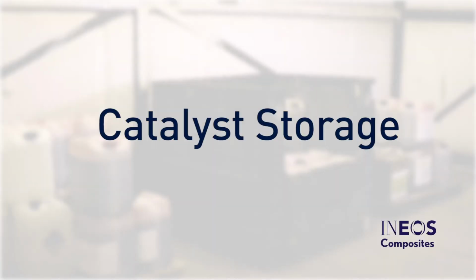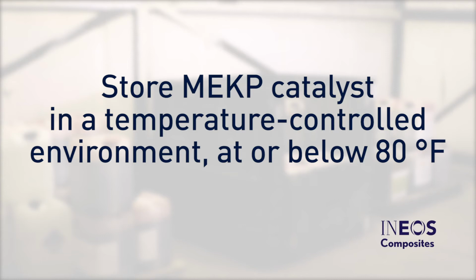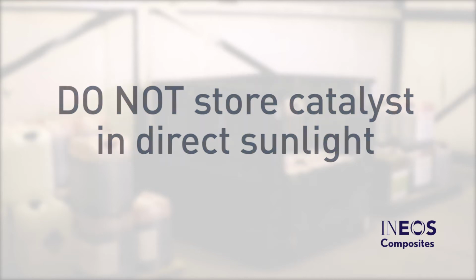Catalyst storage. Catalyst should always be stored separately from gel coat and resin in a temperature-controlled environment. MEKP should be stored at or below 80 degrees Fahrenheit to maximize commercial warranty period. Catalyst should never be stored in direct sunlight.